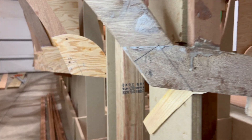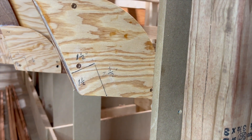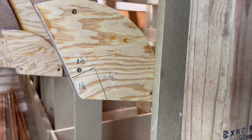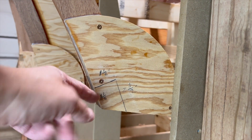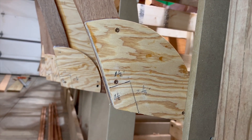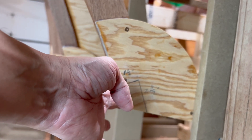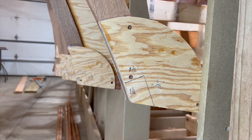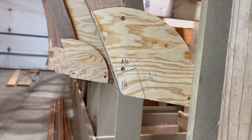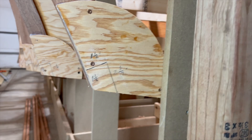As we move forward to frame 13, things change. Notice I made the correction so the sheer clamp rises one quarter inch above the top of the boat, and each of the notches from frames 13 to frame 1 are one and a half inches in the vertical. The side of the boat where the sheer clamp will be parallel is an inch and a half, because the sheer clamp needs to overhang both the side and the top by a quarter inch — so the planking can go on top without seeing these frames.